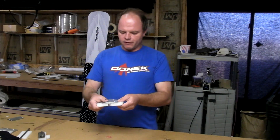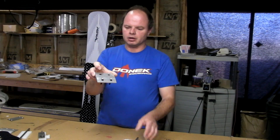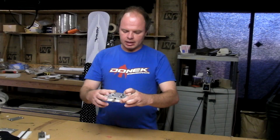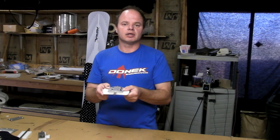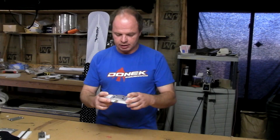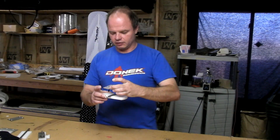On the 4x4 system, we've actually gone to something similar. It's considerably bigger primarily because the screws are so much closer to the center — we need a lot more mass in order to support the shaft. We've also thinned up the plastic plate that sits underneath it, and it comes out a little bit heavier than an aluminum plate over this. But we've still got a little bit of room to machine some material out of there and drill some holes in the plate. We'll test that further before we go to production, but this is extremely close to what we'll be doing in the final version.